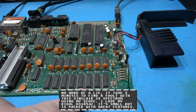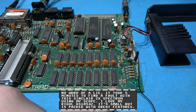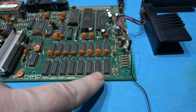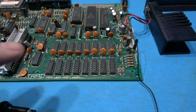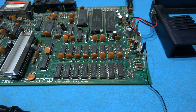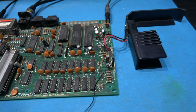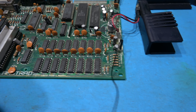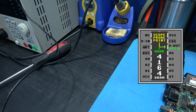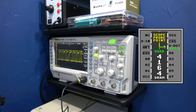If we look at the bottom set of RAMs here, these are connected to the data bus. Each one of these RAMs depicts a data bit — it goes from D0 on the right all the way to D7 on the left. Now I was looking at the addresses; everything looked fine on the address bus. I started looking at the data output which is connected to the data bus, and one of them looks a bit sketchy. I'll go from data 0 to data 7 and see if you can spot the one that looks sketchy. Starting with data bit 0, this is the data out pin — that looks normal to me, some good activity happening there.